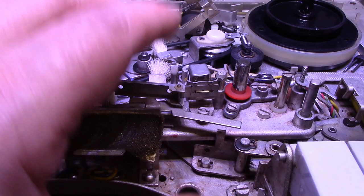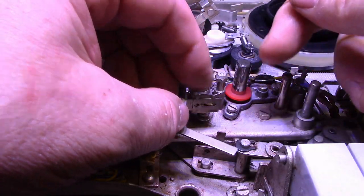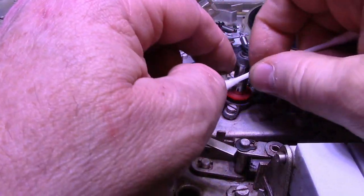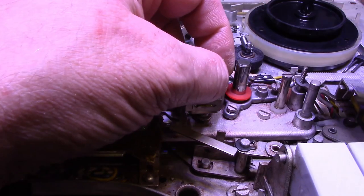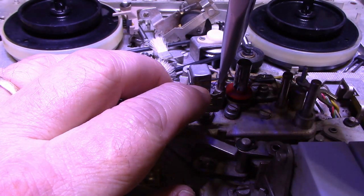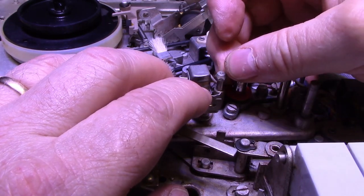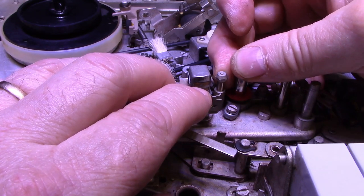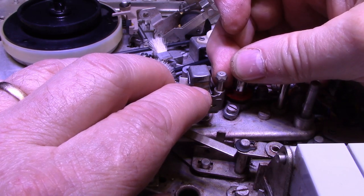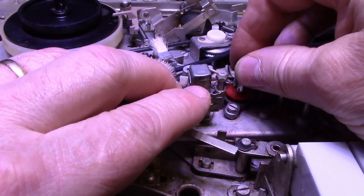It's that brown epoxy. And then of course you got another felt pad here. This can be changed. Looks like it can be changed. I don't know how you would take that apart. There's a pin there holding it. Another guide, this one's non-adjustable, but if I loosen it, you can see, if I spin it around, there's one flat spot on here, quite bad too, if you can see that flat spot. So, yeah, you want to turn the roller or the sleeve so that it's showing fresh material to wear against.